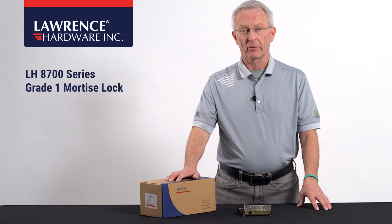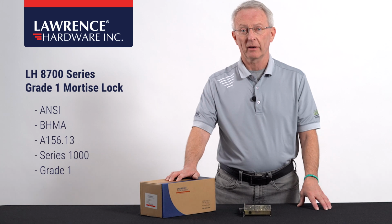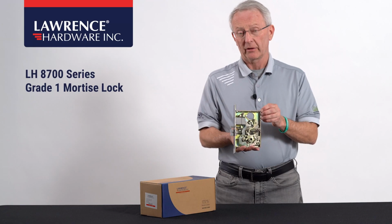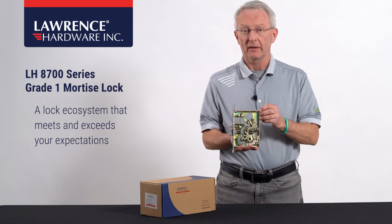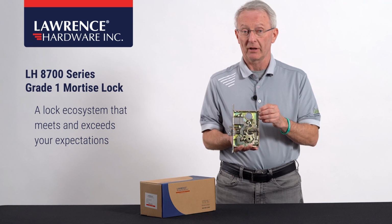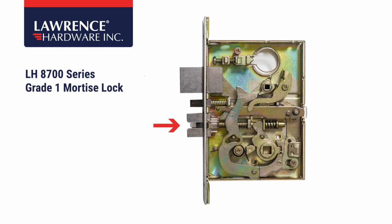Today we're going to take an in-depth look at the Lawrence Hardware 8700 series mortise lock. This mortise lock is ANSI BHMA A156.13 series 1000 grade 1. This particular mortise lock body has all of the add-ons available to make your lock customizable to suit the specific needs of your application. So in addition to all of the myriad of different functions available, the lever designs and the finishes, you have all the add-ons available to meet all the exacting specifications of your project.